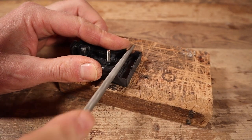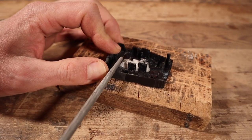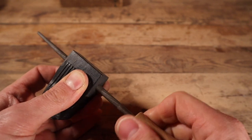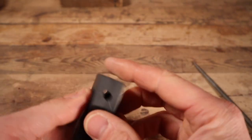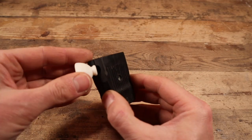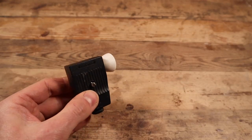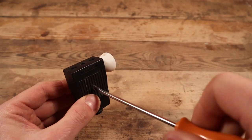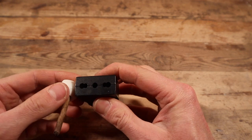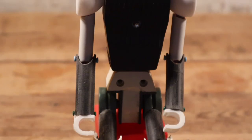I started using a hand drill, and then continue to enlarge the 2 halves of the holes, little by little, with round files of increasing diameter, constantly checking what I was doing. I continued in this fashion until the diameter of the holes was slightly inferior to that one of the pivot joints, and that allowed me to obtain a fair amount of friction once the two parts of the torso were locked into place and held together by the screw.